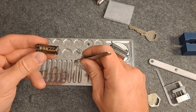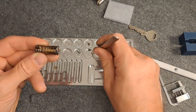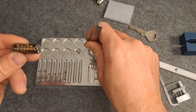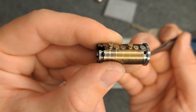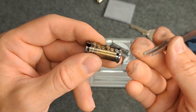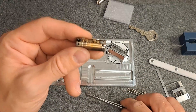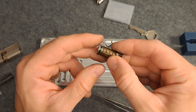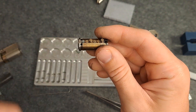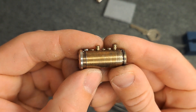What you can do is take the master wafers you now have unused — that you won't need for the key — and just put them in chambers one, two, and three. Then at least you have a working lock where you have to pick all the pins. In this lock, the master wafers don't cause the main problem by giving another shear line at each chamber — the pin work is just horrible. I talked to Hansen and we decided I'll send it back in pieces so he can put in the longer drivers. I hope it becomes a bit more pick-resistant. If I were to pin it up now, I'd do it so at least all the drivers are blocking the shear line at rest.